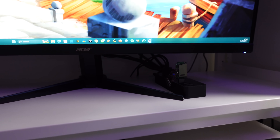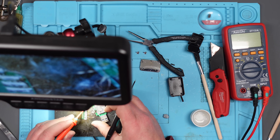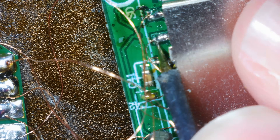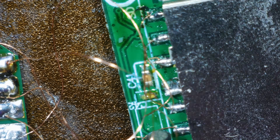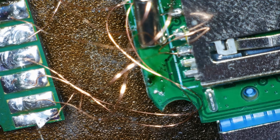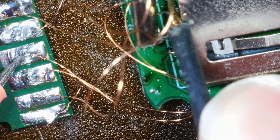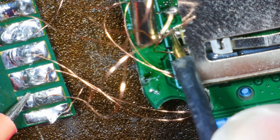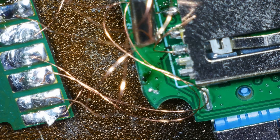Right, let me just double check the connections. Let's double check that they're going from here over here. Multimeter in continuity mode. Checking each one — yes, yes, yes, yes, yes, yes — all getting there. Right, so they are all connected.